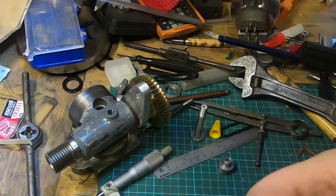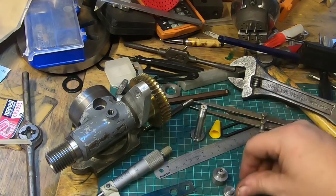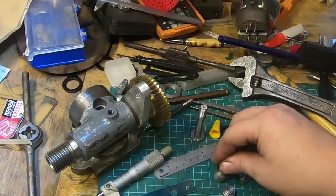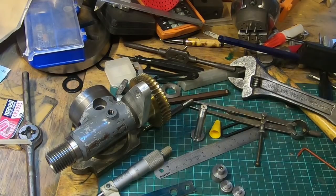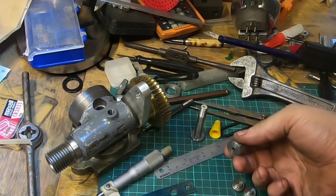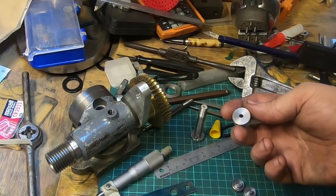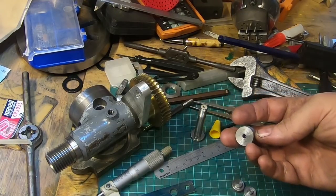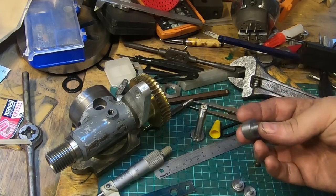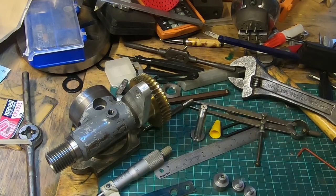So I've drilled it and we've made a couple of buttons out of 4140, which is a molybdenum hard steel. These could do with a bit of a wash up because they are a bit grotty - they're only old scrap, mostly short off cuts that were laying around the shop. I've written a program for the oven to heat these to 875 degrees Celsius for half an hour, give me an alarm, and then I'm going to quench them in oil and file the ends. Let's get these cleaned up and put them in the oven.